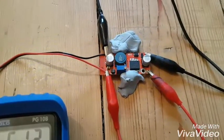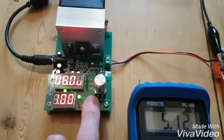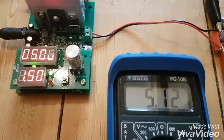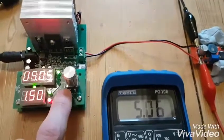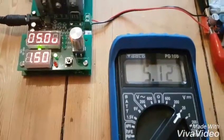So a little 2-pound board - looks like it's doing alright. It claims to do up to 2 amps, 3 with cooling, but I'm only using it on an unloaded C64 so 1 amp is plenty. We'll quickly do it with 1.5 amps. I've increased the amps to 1.5 and lowered the volts back down to 9 volts. 5.12 unloaded - just put the load on. No difference, it's coping. Let's crank up the voltage to about 15. That's on 1.5 amps - that's without the load - no difference at all. Let's crank the voltage up further. Okay - that's with no load, that's with a load. This board looks pretty good.